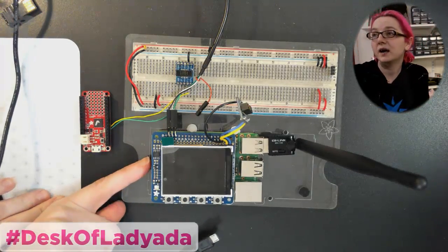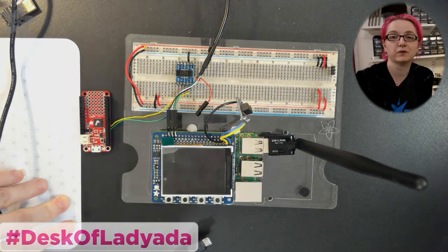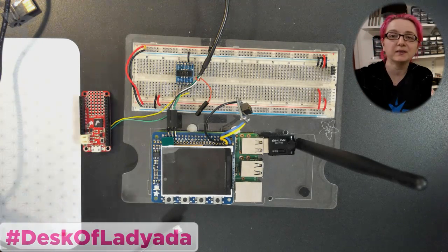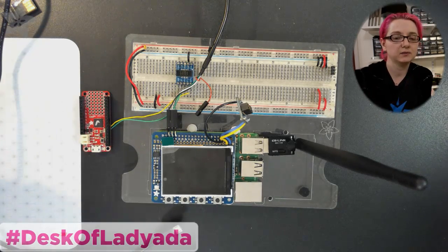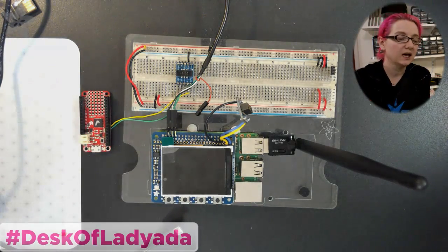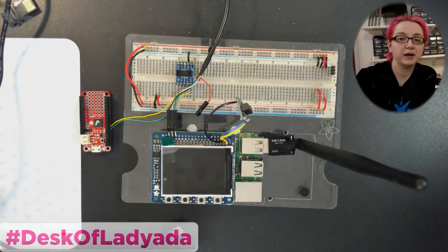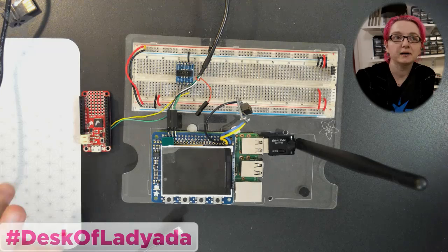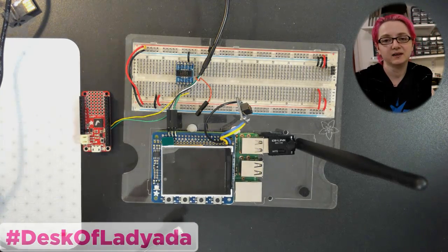What I pretty much did today was I took a copy of Jessie Lite. They just released a new version, so I took the 3.18 Jessie Lite, and I customized it. I'll show a list of all the things I did. I basically installed all the software I thought I would need, like Avahi and OpenOCD and AdaLink, and we've even got J-Link drivers for ARM. Turns out they have released Raspberry Pi compatible J-Link driver code, so that's cool. I'm going to use it for the nRF51822 because it's a little more stable. And just a bunch of other stuff, and PiTFT code, of course, and Python, and Netatalk.